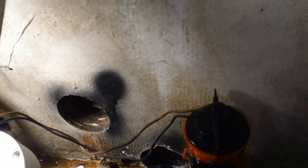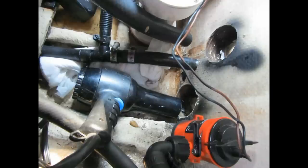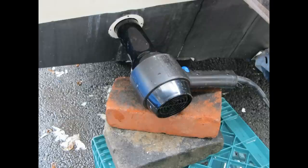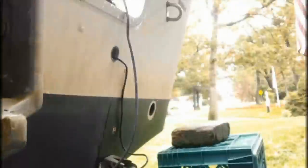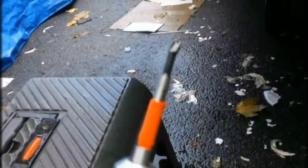The big problem is that inside they were bored out three inches wide in order to install one-inch fittings. These three-inch holes were obviously exposed to water and not healthy for the transom. I'm checking the wood to make sure it's dried up and feels good, and then I'm going to take a drill with a marker on it so I don't drill too far through, and drill some holes above those holes inside the transom to check for wet shavings.